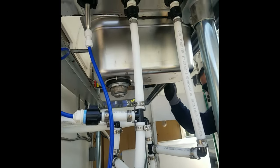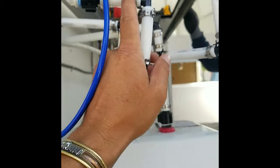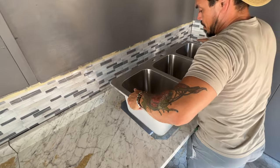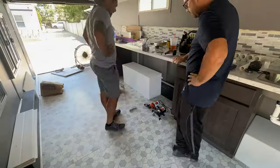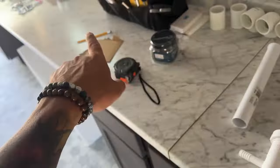Plumbing happens a little bit later in the build — after the floors and after the counters. If you're hiring a professional plumber, give them at least two days. Professional plumbers often say they only need one day, but in my experience they rush the job towards the end. Ideally give them two days or at least a day and a half. If you decide to do it yourself, give yourself at least four to six days. That's one day for cutting countertops and installing sinks, another day to dry fit all your fresh water, another day to crimp everything down and test it, another day for gray water plumbing, another to glue it down, and a full day for mistakes.